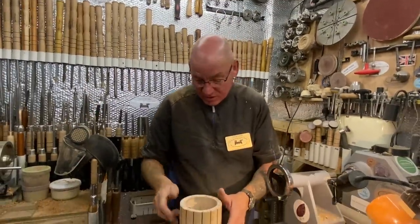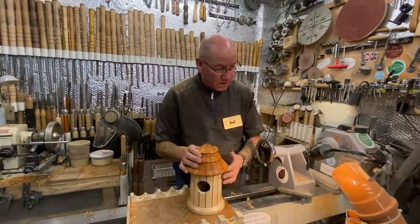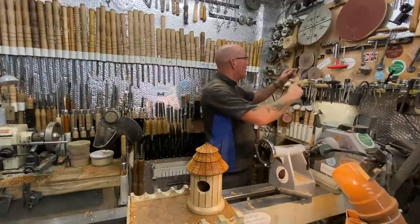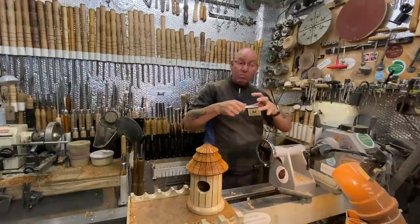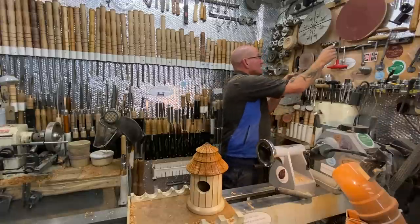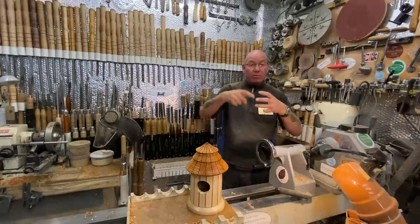Like I say, you'd want something like a thing that goes on your drill, like an arbor sort of fit. Yeah, like a sanding arbor. And if you put one of the sanding mop type ones on, you could go in and sand up inside that. Just make one up. Make yourself a sanding thing that can go in the end of your arbor, like a flap wheel.